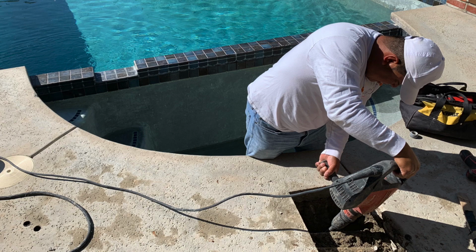Every pool guy, I've seen them once or twice before. Where I'm going with that is that it's hard to plug those things off and it's hard to access them. We were able to take the valve stems off, put plugs in them, but we were able to put the whole thing under pressure without cutting any pipe whatsoever. Check out how we did it and how we used the pool scope to actually listen for a pipe leak.